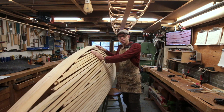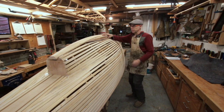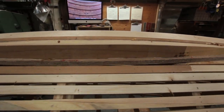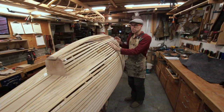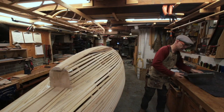Before I get on to doing that, let me show you about roughing out the other side. The biggest area of concern is this deadwood here — there's quite a bit of material, a lot has to come off. I can really hog things away fairly quickly, although there is going to be some grain running in opposite directions here, which is going to make things a little more difficult. So you've got to take your time getting started.